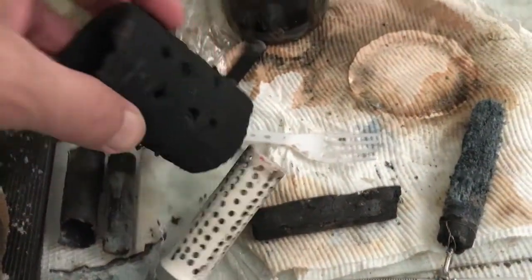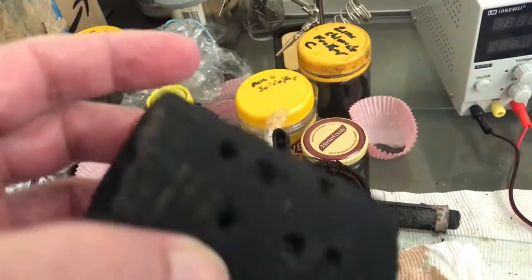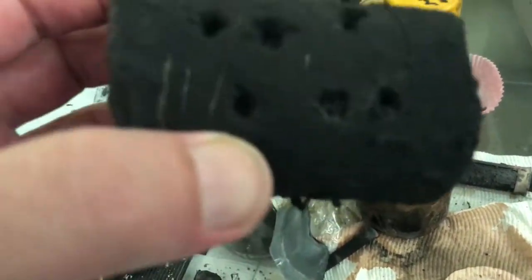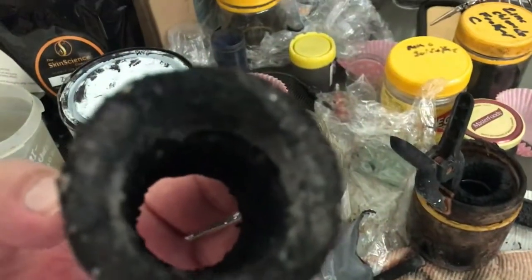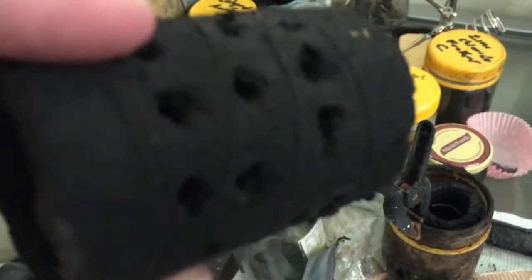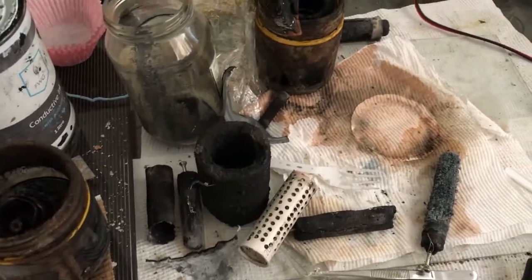The cell's going to be this one, which is coated in the conductive graphene ink with 5 grams of nickel hydroxide and 3 grams of zinc hexacyanoferrate mixed into the graphene ink, then smeared on the inside and also the outside, and also the holes are drilled through there to help zinc movement in the electrolyte. Alright, so I'll get back.